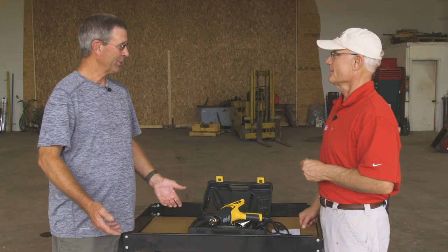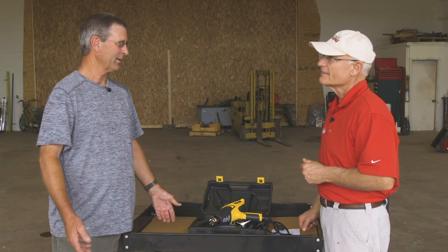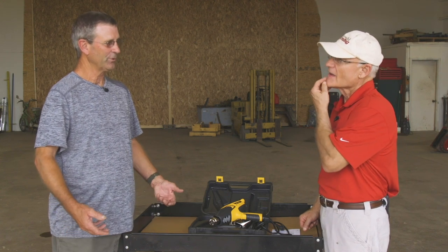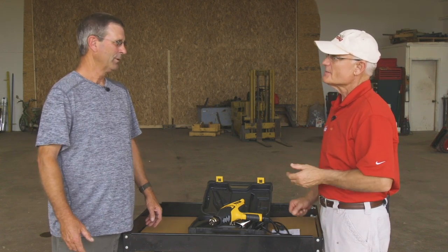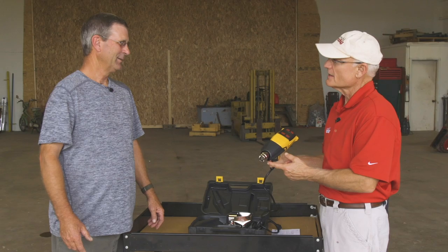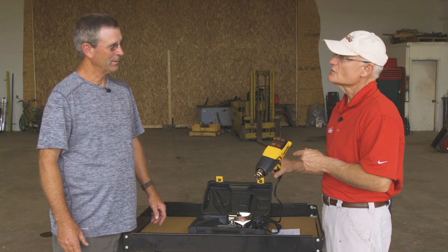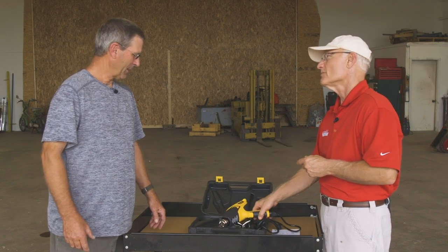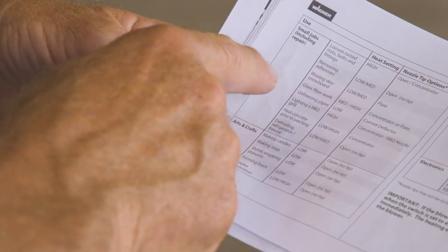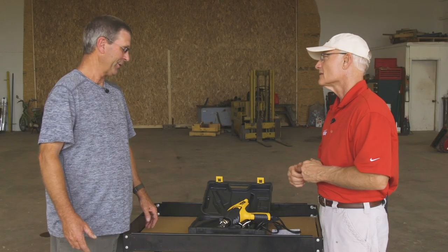If you get parts now, the first thing they do is plaster a sticker right where you've got to slide it on a shaft. Well, instead it works well to get those off, and it loosens the glue, and then you can take them off. So that seems like an underwhelming job, because this one goes up to 1300 degrees that will come out of this thing. It does get hot. Yes. So what other jobs could you use it on in a farm shop? Maybe loosening. Does it get hot enough to loosen bolts? Yeah, according to the directions, they give you settings on how to set it to loosen rusted bolts, which I hadn't tried yet.